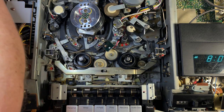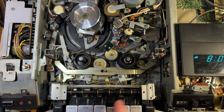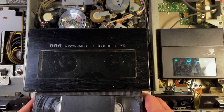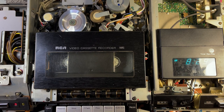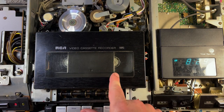Keep that in mind next time you're working on one — it tries to play but then kicks off. Check that out, make sure that belt is on there and it's spinning properly. I did a good bit of cleaning on the inside of the VCR. Let's make sure it still looks like it's working. The head is sounding better — I lubricated it too, it's not nearly as loud as it was. So now if we hit play — kicks in, belt spinning, there we go. Looks like it's going to work good. Let's put the tape compartment back on and test it with an actual tape.